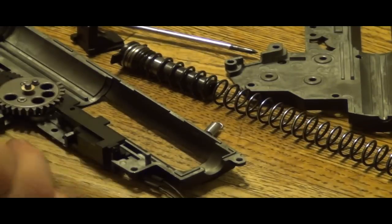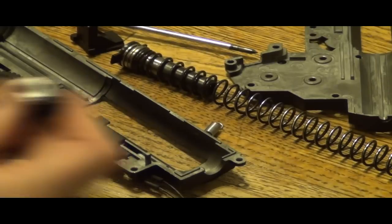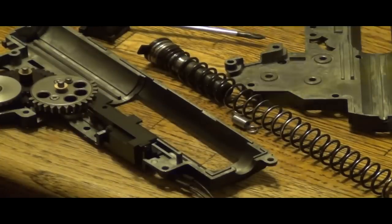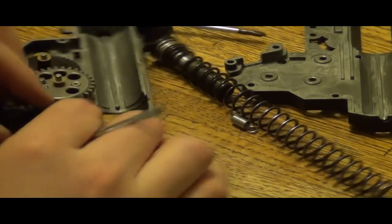Usually one of the most painful things on these is the trigger spring. It depends on the person. Me, I don't usually have an issue. And the way this is made, the spring sits right on top. See, that's beautiful, so it should be pretty easy to install. What I want to do is use a screwdriver to help, and also move the sector out a little bit.